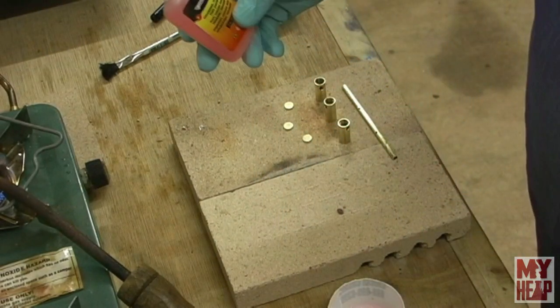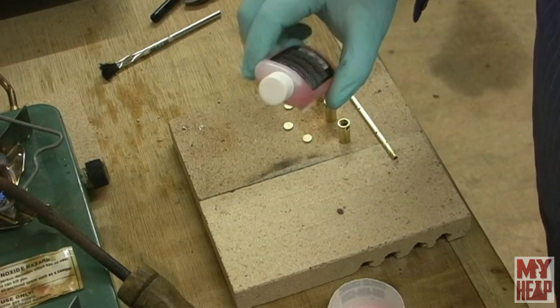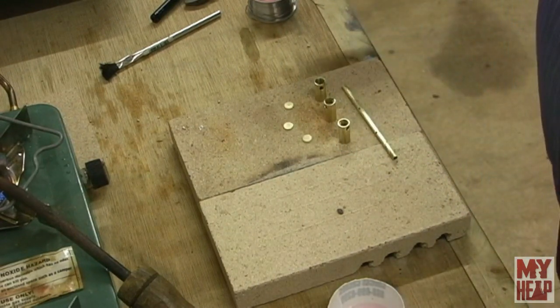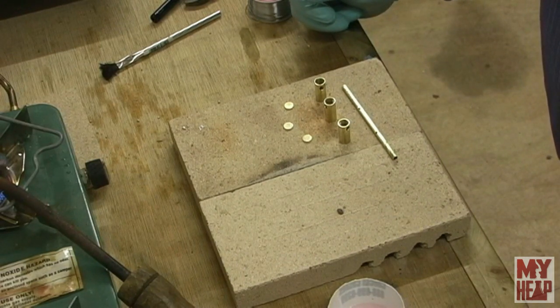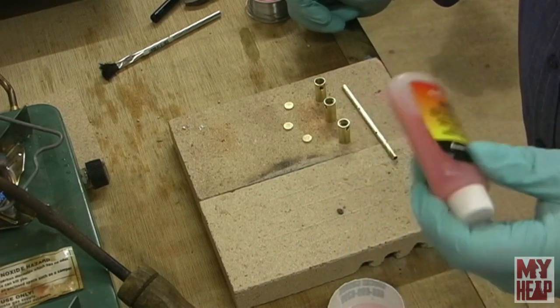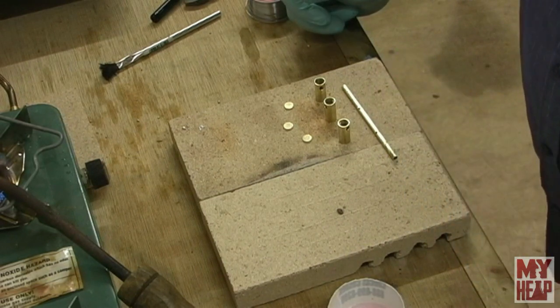Now I'm using Forney's soldering tinning flux. Now this is zinc chloride. So I know a couple of my subscribers, namely Chirpy, says, hey, you can make your own flux by dissolving some zinc into some hydrochloric acid. And I tell you what, if I need more, that's what I'll do, because this was like $6 or $7. It's outrageous, right? And I think I can make a half a gallon of it for $6 or $7.